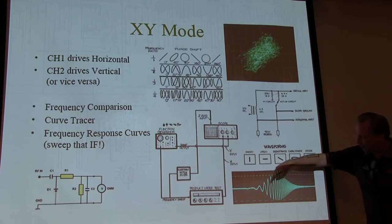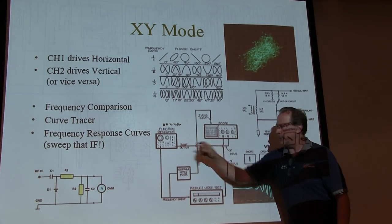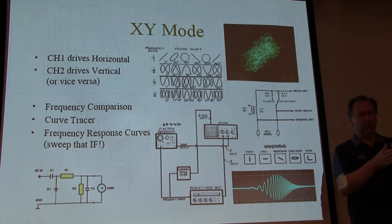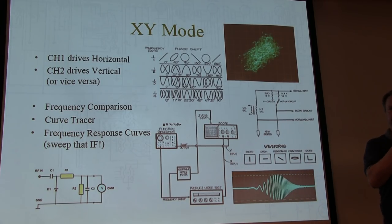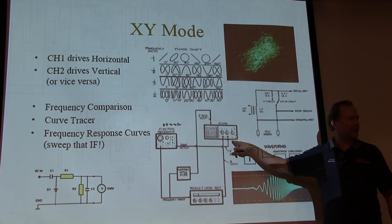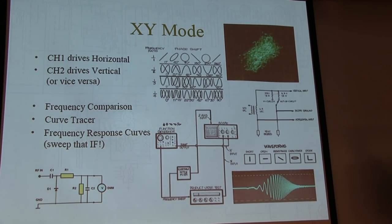This is a very dramatic example of very low frequency sweeping to a higher frequency over a kind of broadband bandpass filter, but you kind of get the idea, you could do that. If your signal generator doesn't have a sweep voltage output that corresponds to your sweep, sometimes they'll just have a sync or a trigger output. So you can set the sweep to, say, 100 milliseconds or 10 milliseconds, and then set the scope up so that its sweep corresponds to the amount of time you're sweeping the frequency, and then set the trigger to external, bringing that trigger signal into the external input. So you trigger the scope at the beginning of your sweep, and every single sweep corresponds with your frequency sweep, and you can do the same type of thing. Pretty cool?